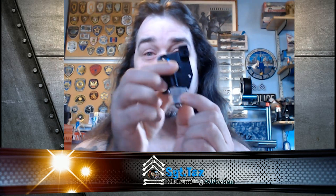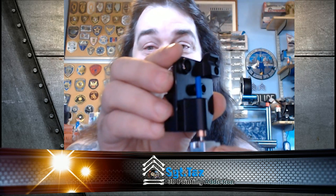Make sure the heatsink is all the way up in and flush inside the cup — it shouldn't be angled. Make sure you do that, set your PTFE liner and filament guide, take your bed down so you don't crash into it, and make your adjustments for level. Use paper leveling, mesh bed leveling, or if you have an ABL, use that — but make sure you do the initial setup, because it may be a little longer or shorter depending on what you had originally. Always remember to re-level your bed every time you change something on your hot end. Hope you enjoyed the video — like and subscribe, I greatly appreciate it, and as always, see ya.